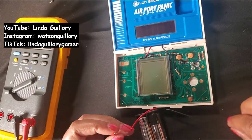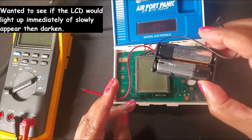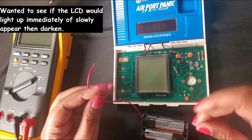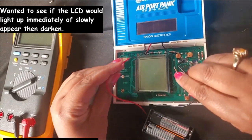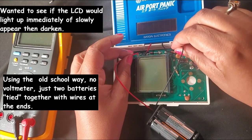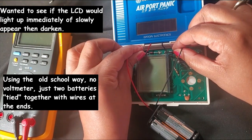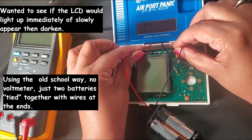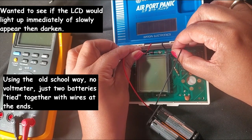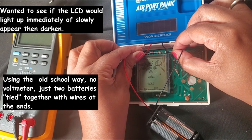On solar games where I don't know if the voltage is getting through, I like to take whatever the voltage is — in this case three volts — and apply it to where the battery terminals would come in, here and here. Then I just see if applying the external voltage will actually get it to come on, and it does.